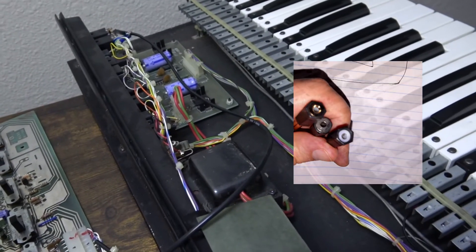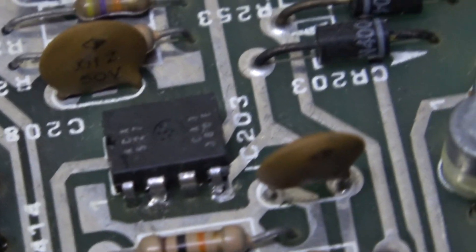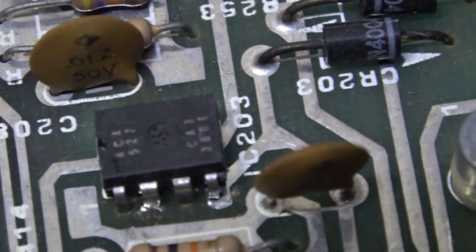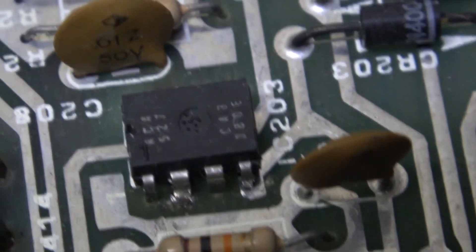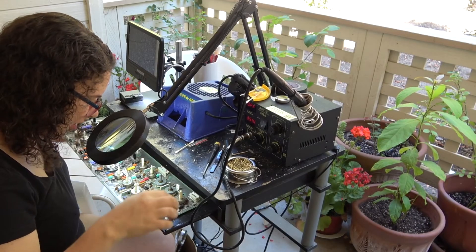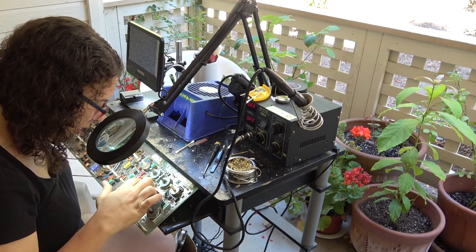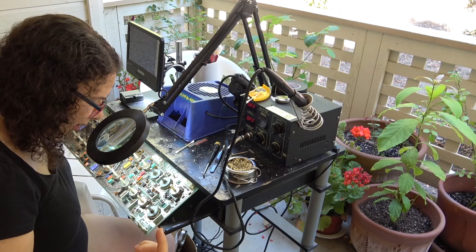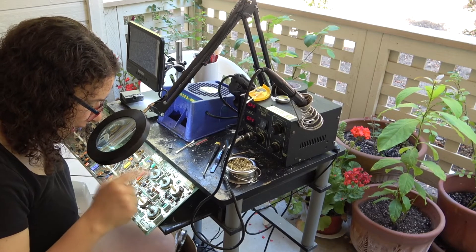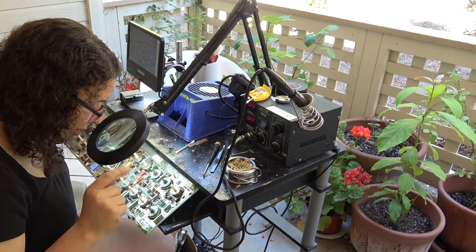What I learned was that my adapter was missing the shielding connection, and that was the first reason I didn't get sound. So I'm looking at IC number 203, and one thing I noticed is that one of the legs is not really firmly attached to the board. I had to take special care to get solder down onto where this pin went in, because the trace is not connected on the bottom of the motherboard but is connected at the top. I had to make sure the socket is actually connected to that trace on the top of the board, so I'm going to do a continuity test for that.